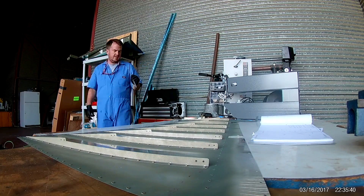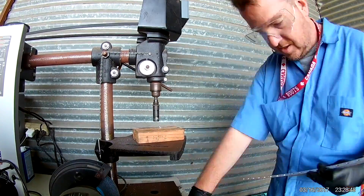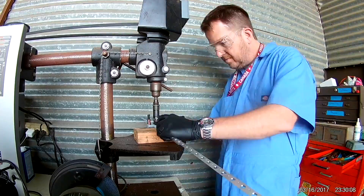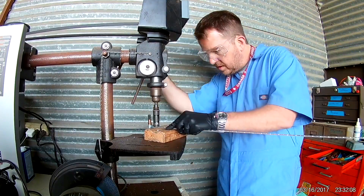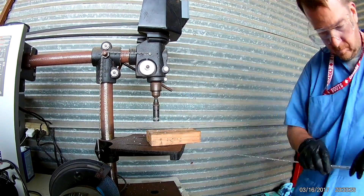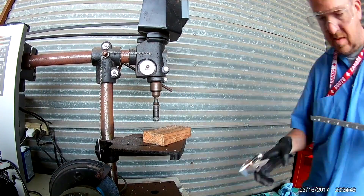Just then I had to dimple one hole at the top of each side of the rivet that actually goes with the rudder fairing. You need to make sure that's dimpled to an eighth of an inch. So here I am countersinking the trailing edge of the rudder. You need to make sure the countersinks are perpendicular to the face of the trailing edge. And it is a wedge shape.